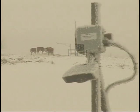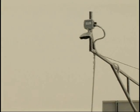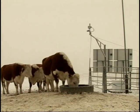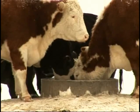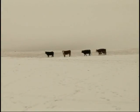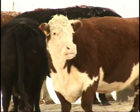This particular installation here uses a motion eye to run a pump. The water is always at seven feet below the frost line. When the cows come up to drink, a motion eye picks up the cows and fills the bowl with water. The cows drink, and as soon as they're finished and leave, the pump shuts off and nothing freezes.